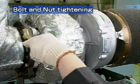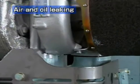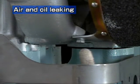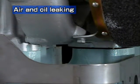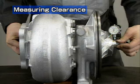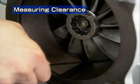About once every 2 weeks, check that every bolt and nut is still tight, and that there is no air or oil leakage. When engine operation reaches 2400 hours, remove the turbocharger from the engine and measure the thrust, radial, and exhaust casing clearance. For the detailed procedures, refer to the section on inspections every 4800 hours.